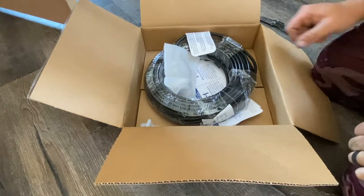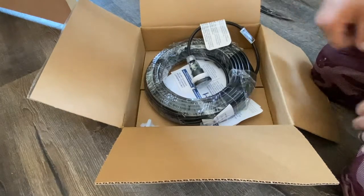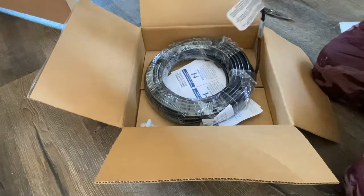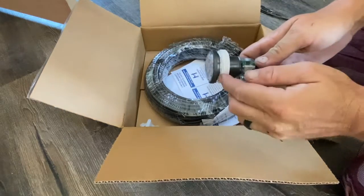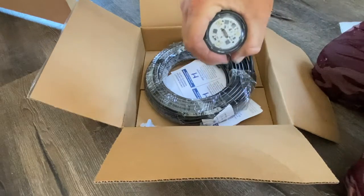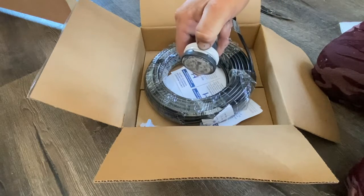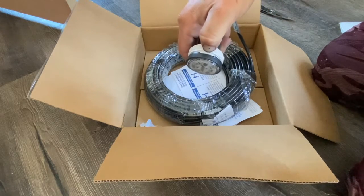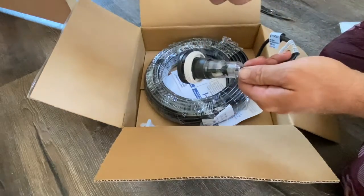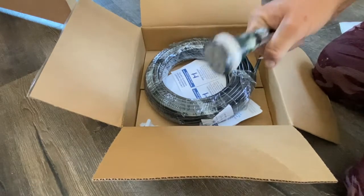If you're in a climate where you're not overly worried about hard freezes in the wintertime, and your equipment is above the water line, then you can do a wet seal. Then it's ready to install. It has this PVC ring right here, but the light is facing out into the pool, and the water can get around this ring, between this PVC ring and the light itself, and then water is just getting in behind here, and it's in the conduit. Okay, no big deal as long as A, you're not worried about it freezing, and B, that you're above grade.